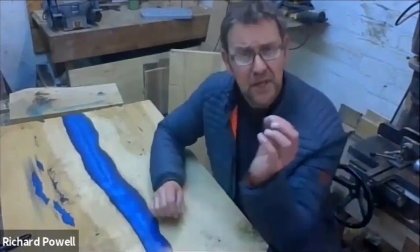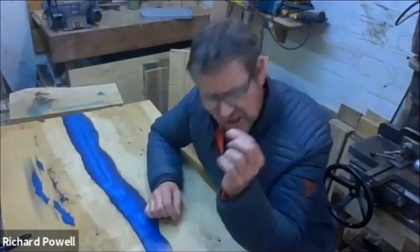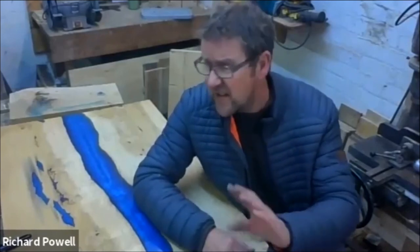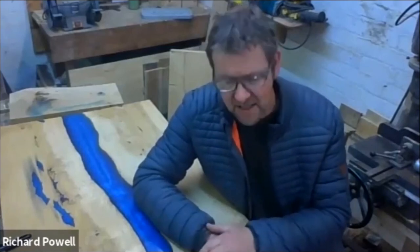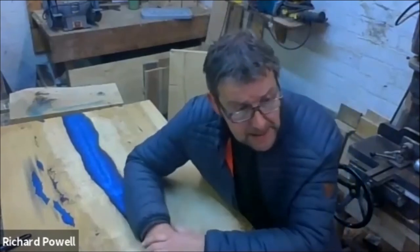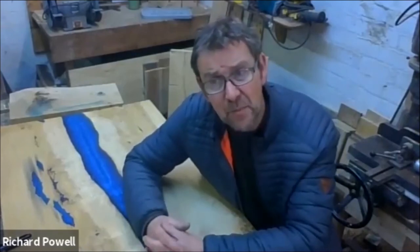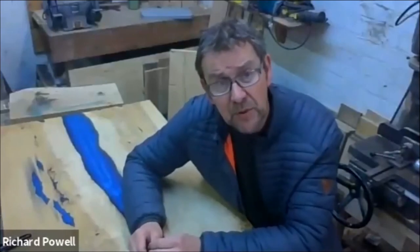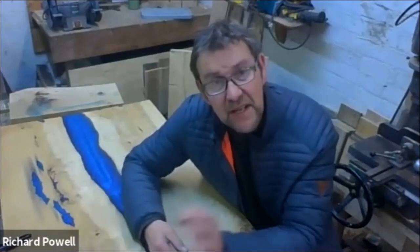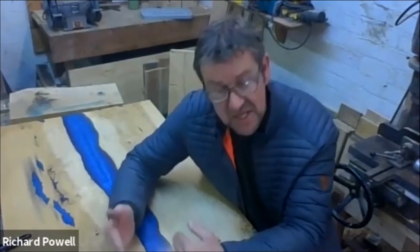Check the resin carefully — if you haven't got rid of all the heavier grit sanding marks from the start, they will show up. Very important to get it down to about 600. Once you're happy with your sanded finish, Osmo oil is probably the best finish to use, though it is expensive. It's also food safe, so it's worth considering for cutting boards or chopping boards.